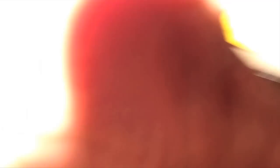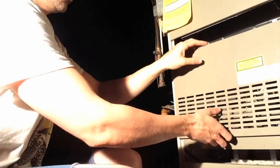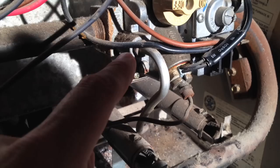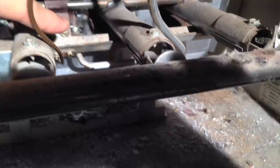Now here's how you do it. I'm going to set the camera over here — it's pretty easy. You just take this off. You've got to make sure it's off. Here the unit is turned off. There's an off/on switch — make sure it's turned off so there's no power or anything gonna mess you up. So you take this off and right here it's in the off position. You're gonna turn this to the pilot position where it says pilot, but first you've got to follow that long tube that's filled with gas that the gas comes out of.